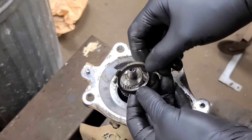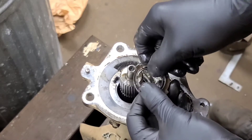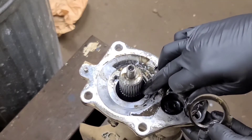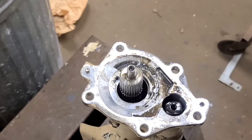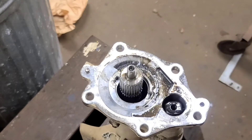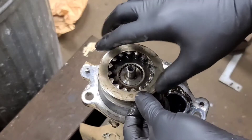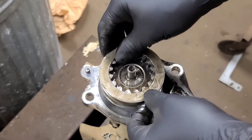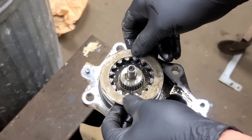You can see that washer is worn significantly, and this is the only thing that holds this axle in - that round snap ring - and it just pulled right through as you can see. In my opinion they should have a square snap ring in this groove rather than this round one. This round one is probably in here so that the axle shaft can be pulled out to service the axle seal. This design has changed from the previous design where they actually had a gear and a sliding collar. Tomorrow I'm going to check on the availability of that thrust washer and a new snap ring - I think it would be better with a square snap ring in this groove.